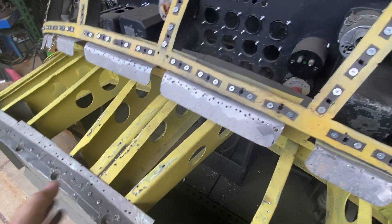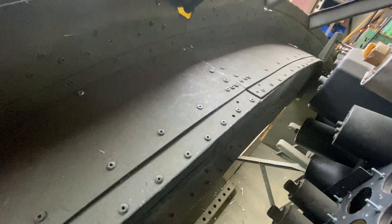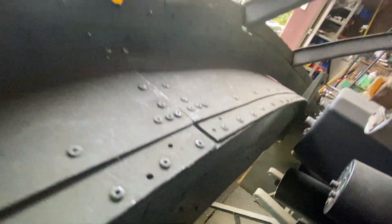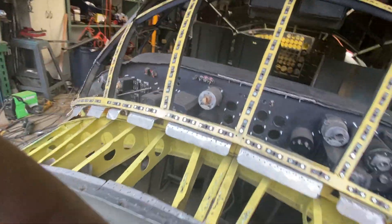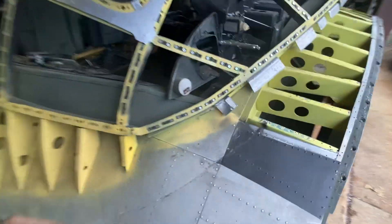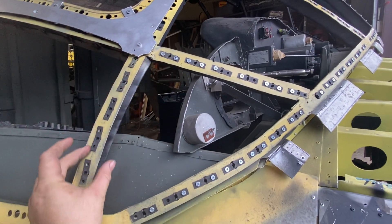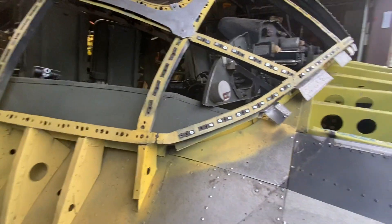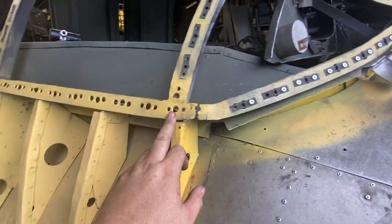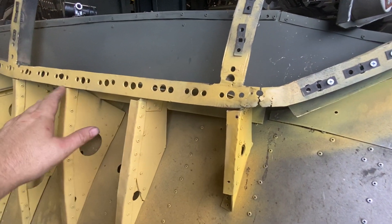When I get around to it — probably in the next couple of days — I'll install and rework these stringers, reattach them up front. I'll have to take the instrument panel out so I can access bulkhead 1.1. There's a whole mess of rivets where these stringers attach. This snapped from the torque of installing these, but that's no biggie. I'm going to clean this up, then take that same idea of dropping these down with steel and do the same thing around here, which is true to the actual aircraft and will give me a place to mount or fasten the side panel fairings.